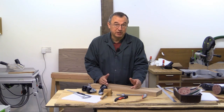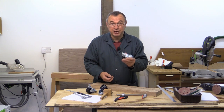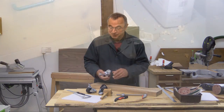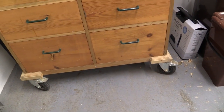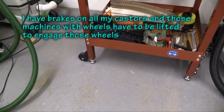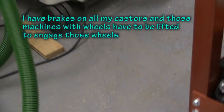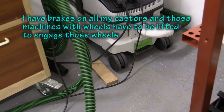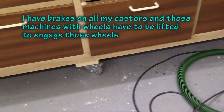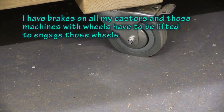When you do something like this, you've really got to do it very carefully and make sure it's going to be safe. You've also got to make sure that your casters have brakes on, because there's absolutely no way that you should operate a planing machine on a moving platform. I've used casters on quite a few of my little benches and machines in the workshop, and all of the ones I've put in have got brakes on. If you do decide to go for casters, make sure they're braked, but also don't go for the cheap ones. I bought some casters with little grey rubber wheels and it was an absolute disaster — you can see how the rubber has squished down and they are useless. So buy the best quality caster you can afford.